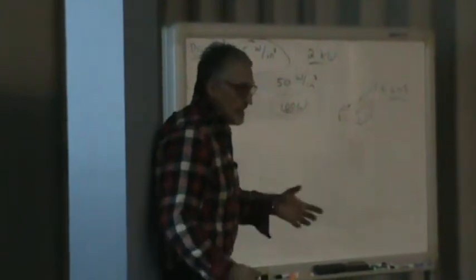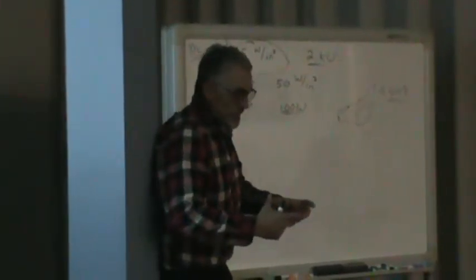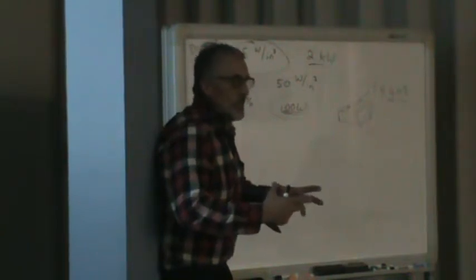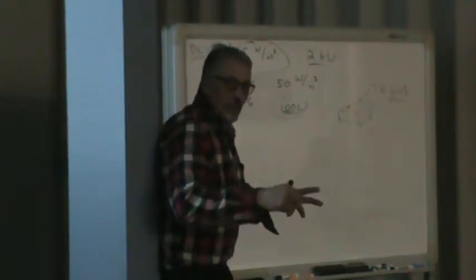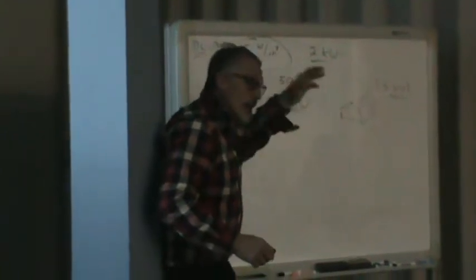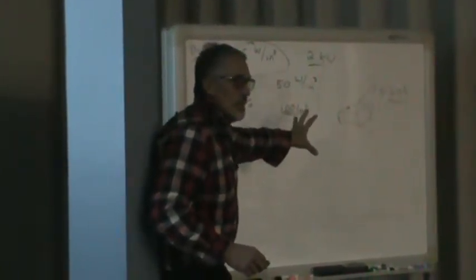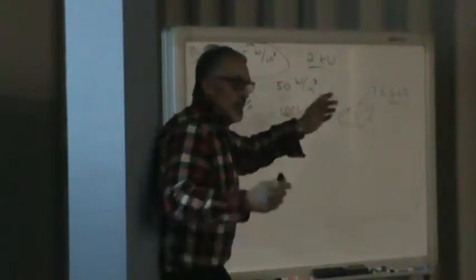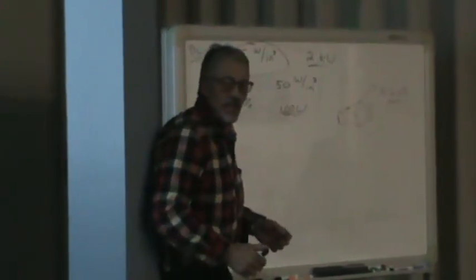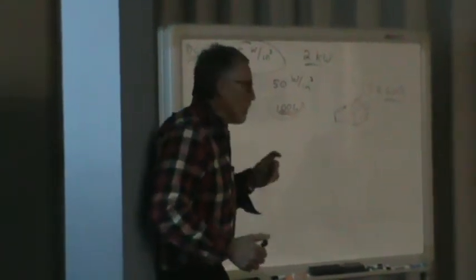So we built, and I meant to bring it, one of our prototypes halfway through that's got fake components in it, but we could heat them with resistors and stuff, and we could compare my experiments to my numbers. But one of the things I did halfway through is I got tired of running the finite elements, and I made a little heat transfer model that was pretty close, so that I could run it in MATLAB in like 10 seconds and evaluate some of the major changes. And so that's what I've used here.